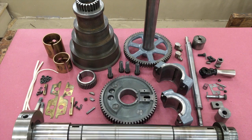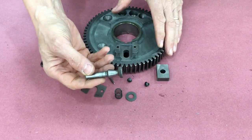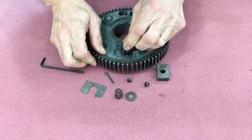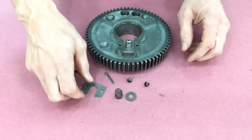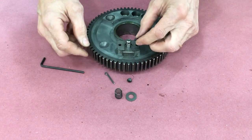You can see the bronze bearing on the top left and the spindle on the bottom. This is the bull gear and the bull gear clamp assembly. First we start with the plunger, then put in the clamp, then goes on the clamp gib, held there by a couple of screws.